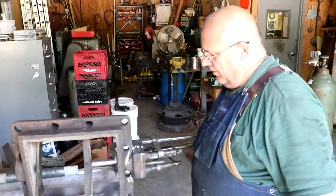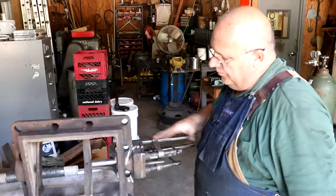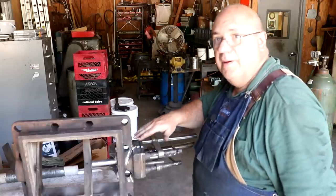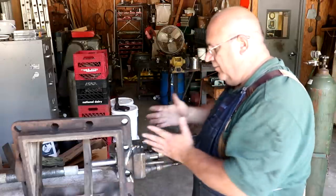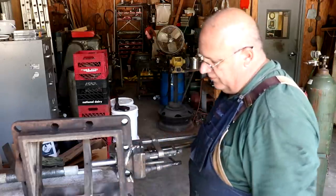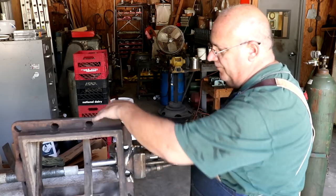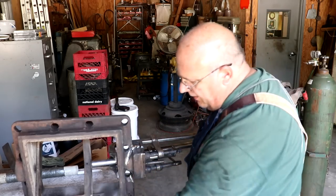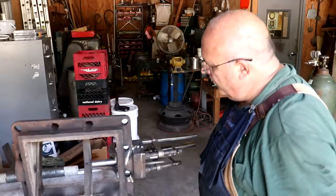We're going to get in here and start to braze up these ends first, with the hope that this will serve a little bit as a dam to hold my braze in as I come across this top. So I'll do this side, then we'll flip it over to the other side. I've got it sitting on some 2x4s where you've got this crease in here on either side. I got a fire blanket in here just to hopefully keep the heat off those 2x4s, keep them from burning.